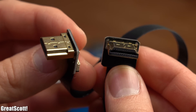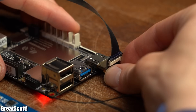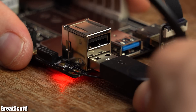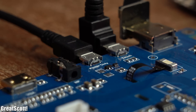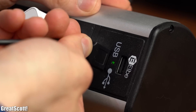Next I used a small flat HDMI cable to connect the display to the Latte Panda, used a micro USB cable to connect the touch port of the display to a USB port of the Latte Panda, and finally used another micro USB cable hooked up to the power-only port which I connected to a separate 5V power source.